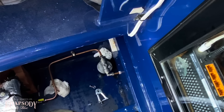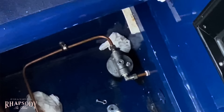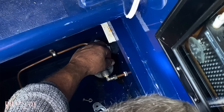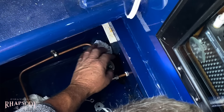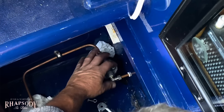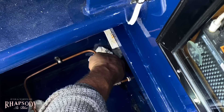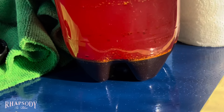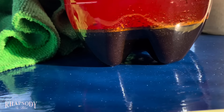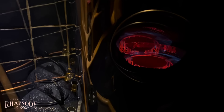Hopefully that will bleed through. You can see the diesel - it's started coming out. So that's it - we've bled that up. Now we should be getting diesel down to the stove. So thankfully after three attempts our reflex stove is now working fine again.